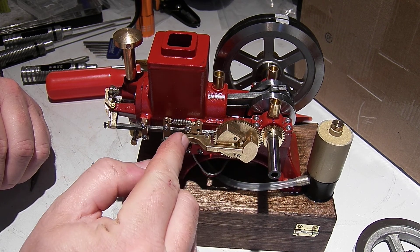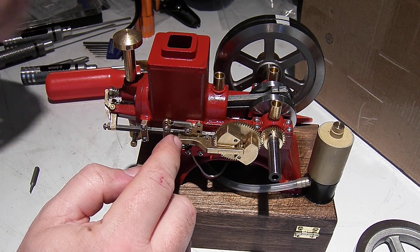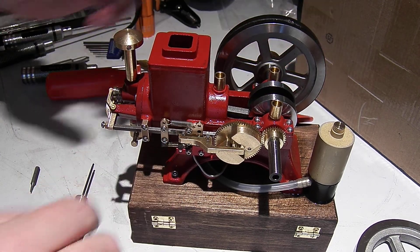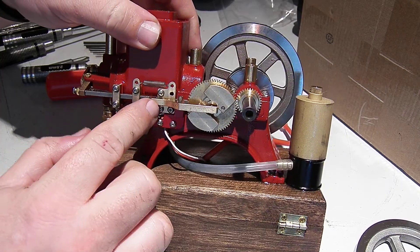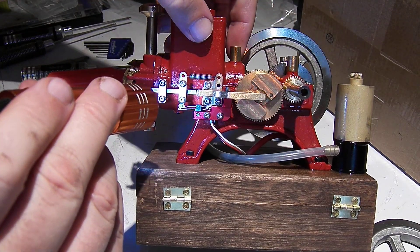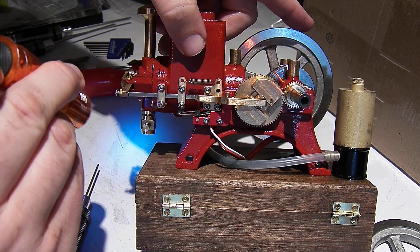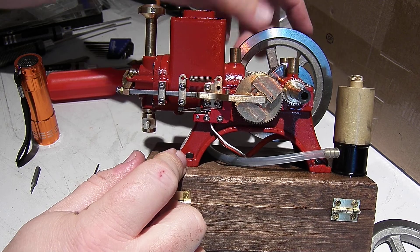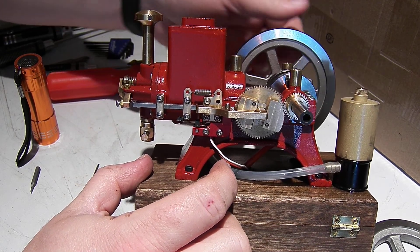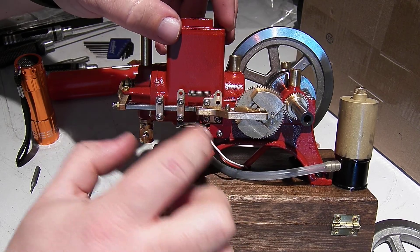There's also a millimeter of gap here, so there's room for me to put a shoe on the end. There's a millimeter and a half space between the full travel of the push rod latching space and the pawl, so I have plenty of room to build a tiny better-profile shoe that I'll just probably super glue on the end of this pawl.